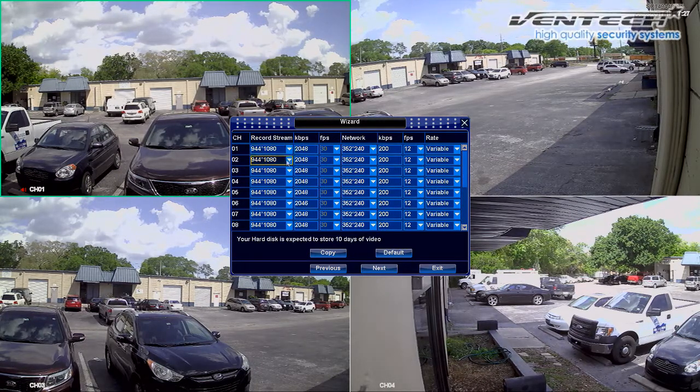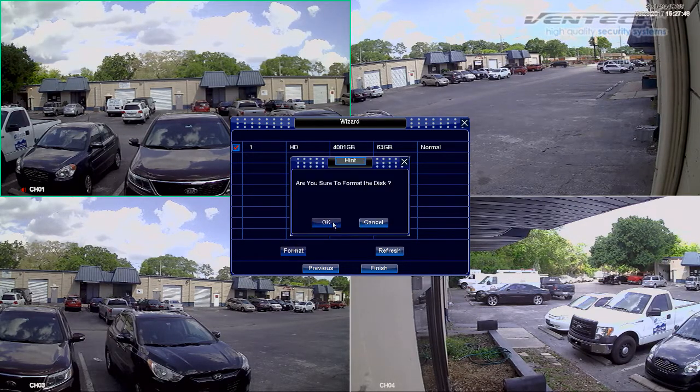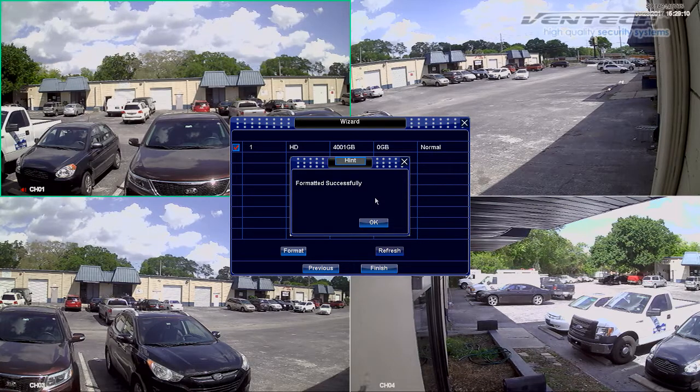Here you have the video resolution of each channel — please do not modify this option. Next. At this point, you can select between recording your videos to your pen drive or to your hard disk. For this video I am using a 1TB hard disk. Let's format this hard disk by clicking on Format. This process will take a few minutes. It doesn't matter if you are using a brand new hard disk or a brand new DVR that includes a hard disk — please always format the hard disk after you have finished. The status here should show Normal. Now it's done — press OK, and we can start recording all our videos.